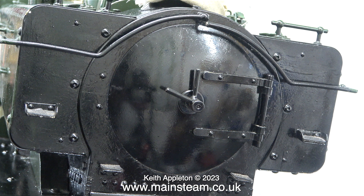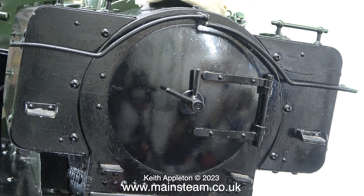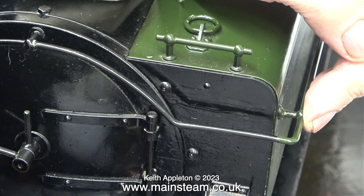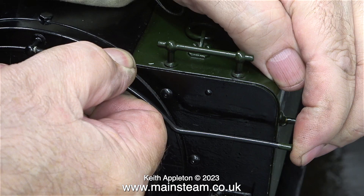Time now for a cosmetic repair. The handrail was broken at one side of the engine, it's time now to fix it. I'm using cyanoacrylate adhesive on the front stanchion and the broken stanchion at the left hand side — I also mean on the right hand side of this image. I held the broken part in place securely until the cyano had cured.